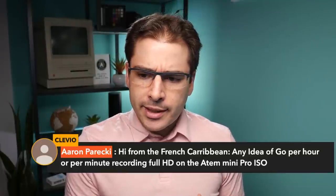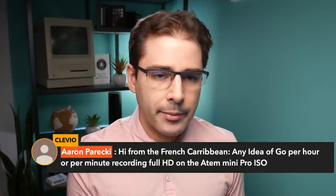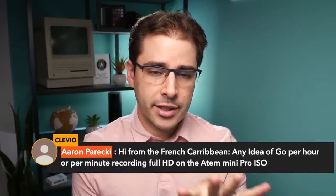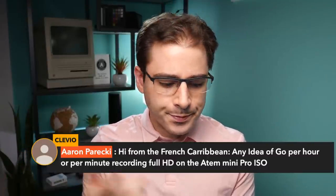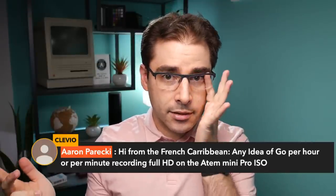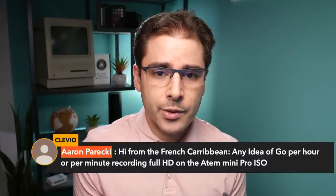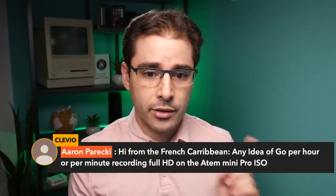Any idea of, I'm assuming that's gigabytes per hour or per minute recording full HD on the ATEM Mini Pro ISO? I don't remember off the top of my head. It does record 70 megabit per second ISO feeds. So each of the four will be recorded at 70 each, plus whatever your program out is. So if you're streaming, that's 6 or whatever, right? So 280 megabits a second ish, so 300 megabits, let's say. What that translates into gigabytes per hour, I don't know off the top of my head. That's some math you could do. I will say that when you plug in a hard drive, it tells you approximately how much time is left. So that's one thing you can look at too.